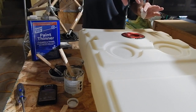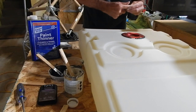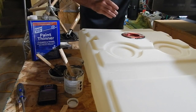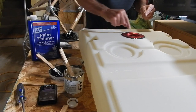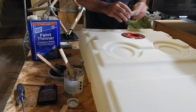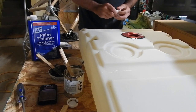Then I'm going to take my screws out one at a time, clean them, and put them back in again, which is what the instructions say. And then I think I'm done with that part of the sealant. I believe we do one more application of the Pro Seal after we get the tank in. We fill this gap up inside the skin so that if you spill any gas, it won't go into your wing. But I think that's a separate application, a second application. But for this one, I think we're good.